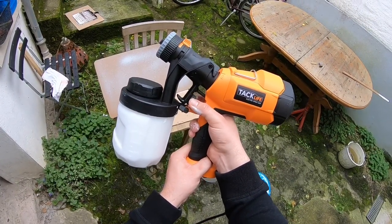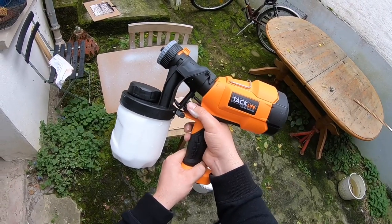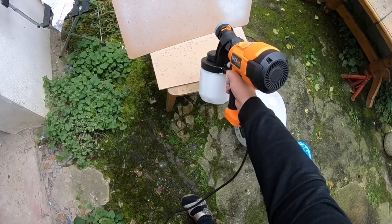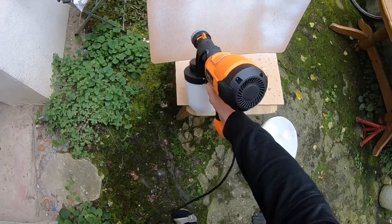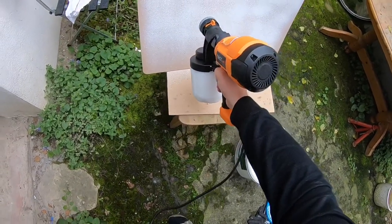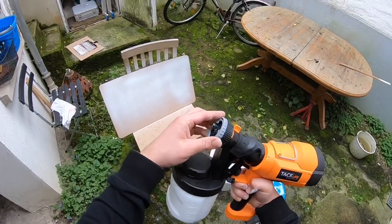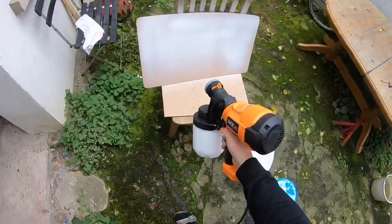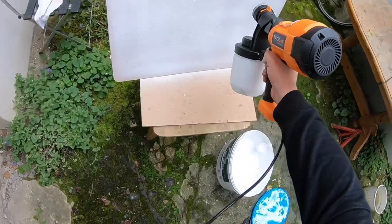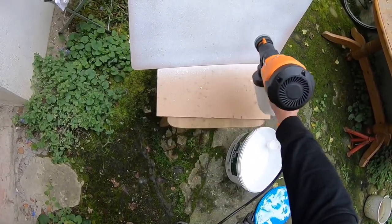So you see, in this package, every part can be easily painted by this gun. It is a paint sprayer. You have to fill in the paint first, then choose the right valve, and then you can start, but take care, the liquid has to be so thin that the nozzle and the valve will handle this. And if you have a balanced setup, then you can start with the painting. Start it pushing, don't shoot in the air with this gun, only do this horizontally, and then it is easy to use. You have so many different things to combine in this setup.